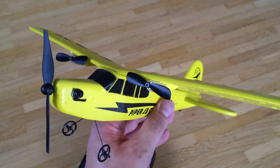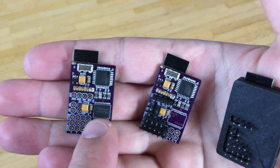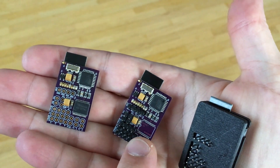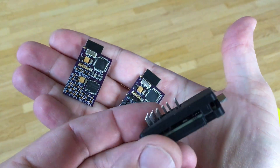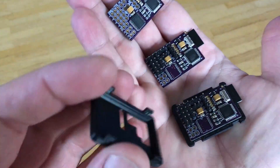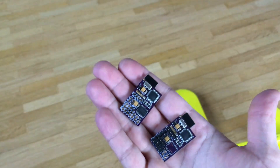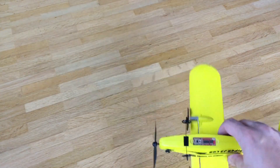So why not just replace it with my micro RC receiver? Recently I assembled a new batch of three — this one with the TB6612FNG dual channel motor driver, this without one. And this is the 3D printed housing, which can be downloaded on my Thingiverse. Two units will be used in cars which currently don't have a receiver, and this one I think will go inside this plane.